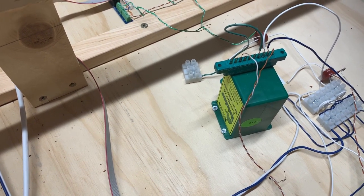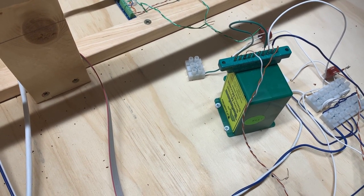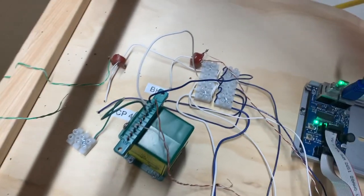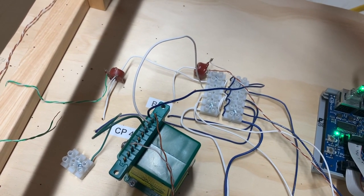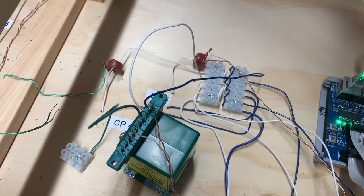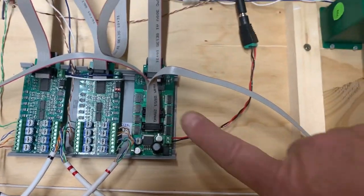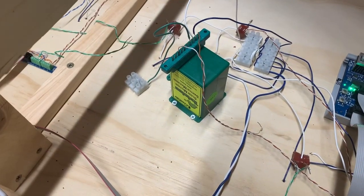So you have to be very careful about how you place them on there, or you can get your positions overlapping each other, which is exactly what I did. And unfortunately, when I did that, I had already hardwired my layout in, and I shouldn't have done that. I should have known better, but I had my layout hardwired in, and so I got that short, and I guess it fed back into my stall motor driver. So I blew a channel on one of my stall motor drivers, which happened to be the one associated with this tortoise.